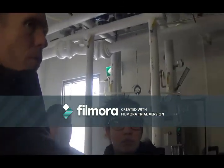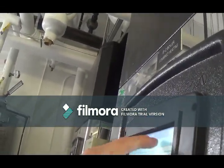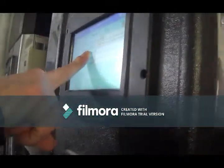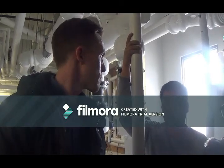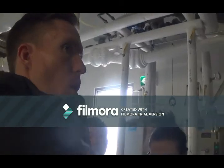Oh, okay. So you're in configure, central heat. And then it's underneath modulation, which is a header. And then you're changing modulation rate source to local. You can do that too by changing the set point. Yes, you can do everything in there.